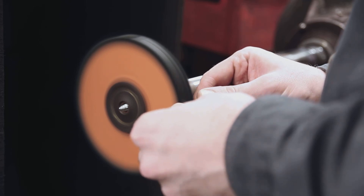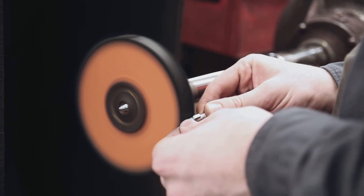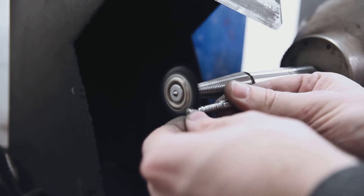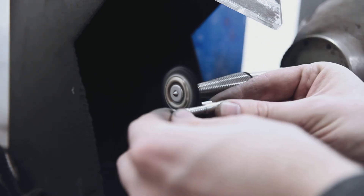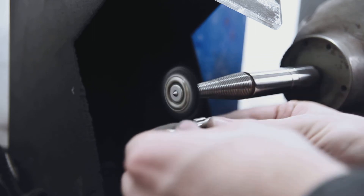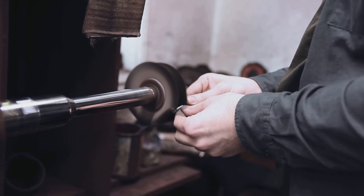I used three different steps in polishing. This first mop uses a heavy polishing compound to smooth the majority of the surface, getting rid of the larger marks left over from the emery paper. Then onto a final bristle brush to get into the small grooves of the lightsaber — this uses the same polishing compound as the previous. And finally a soft rouge mop, which allows for a high polish finish on the part.